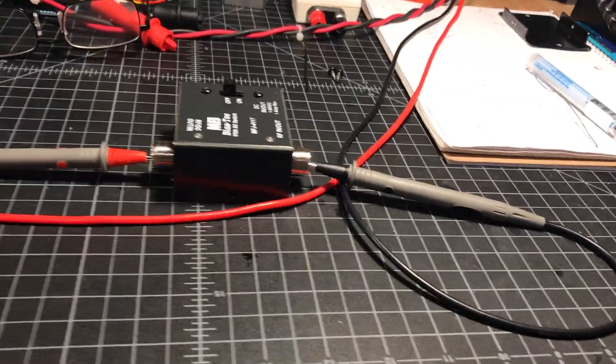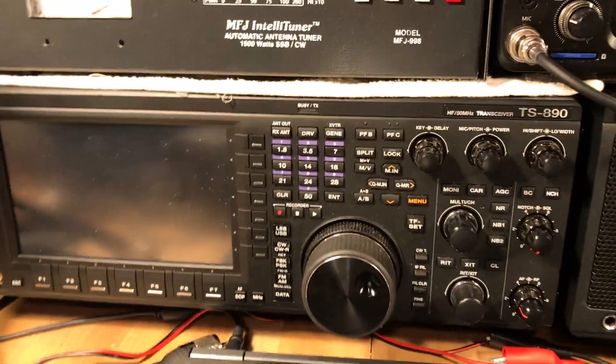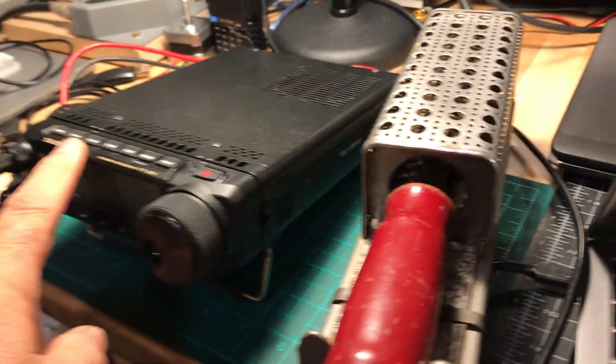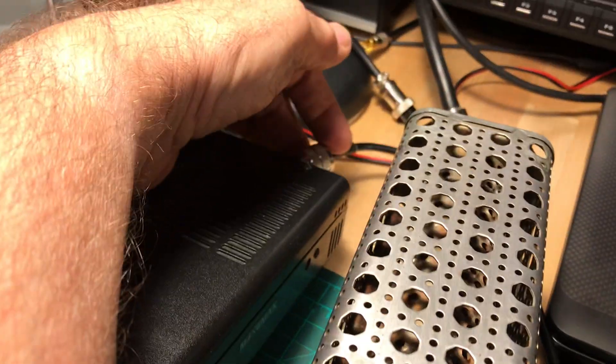We found a secondary problem. I had my Yaesu radio connected to the Bias-T because I apparently blew the finals up in my $3,500 Kenwood and I needed a radio to use. But when I disconnected the power, the backlight was still on and some of these other lights were flashing. I would disconnect the antenna terminal and it was okay, but when I put the antenna terminal back on the radio, weird lights started flashing.